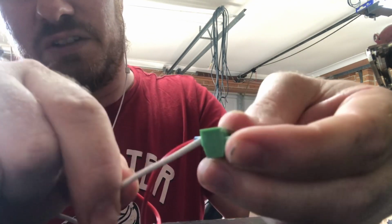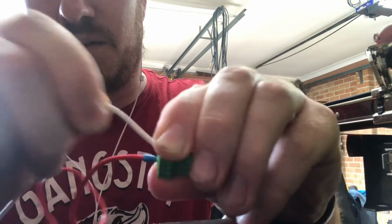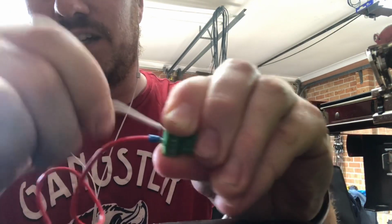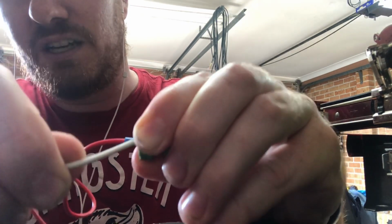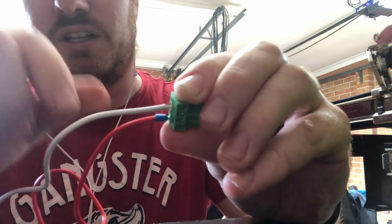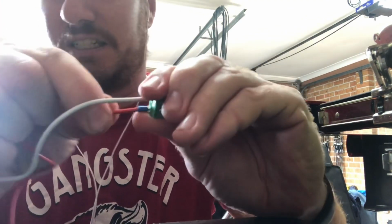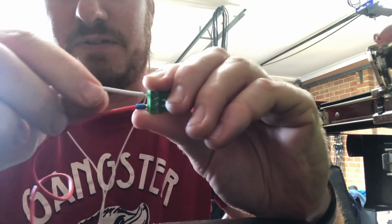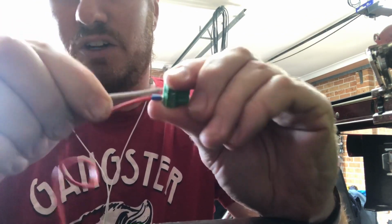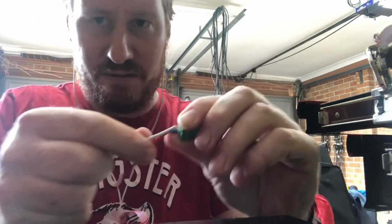The problem when you don't use them is, like we said before, the wires can splay out, but also over time, with heat and everything like that, as you pull them out, you can get wires that cross over with another one and cause a short circuit. These are much stronger and much harder to pull out. You'd probably break the connector before you'd pull the wire out of the ferrule. With a normal set of wire, if something fell and pulled the board down, it could break that really quickly as well.